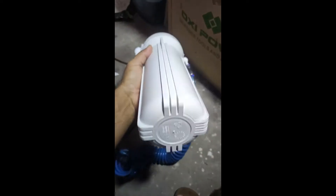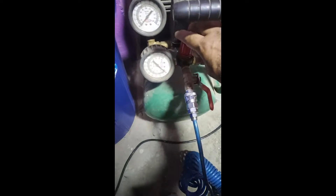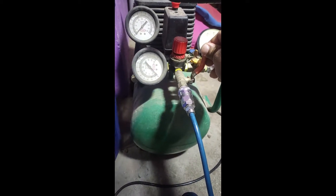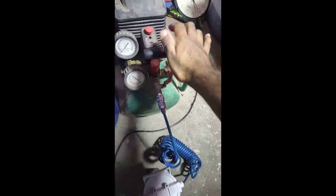Once it's airtight, give it pressure and you get moisture-free air from the outlet. This is the moisture separator we made. I'm going to test this with a 30-liter capacity compressor — first pressurizing up to four bar and then releasing, to see if the canister is able to hold the pressure.